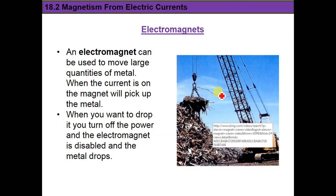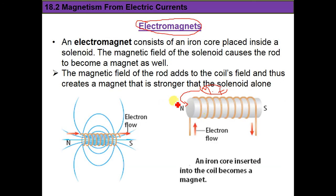You can do this experiment using just a battery, a nail — which acts as the iron core inside — and copper wire. Wind as many coils as possible around the nail, because more coils mean a stronger magnetic field. When current flows through the solenoid with the iron core inside, it works as an electromagnet. If we don't have a magnet, we can create one using electric current flowing through a solenoid with an iron core inserted.